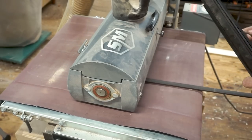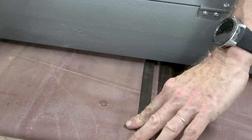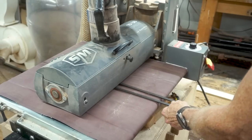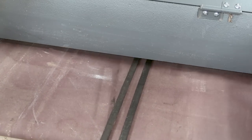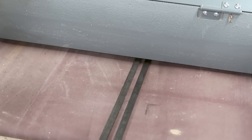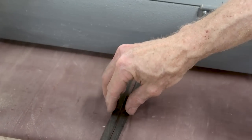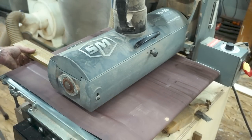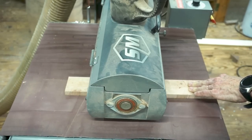Next, I'll take some pieces of ebony and prepare them to be the dividers. I never throw out anything, so these are leftover pieces of ebony from another project that I had tucked away. I just need to sand them all to the same thickness. They ended up to be around 3/32 of an inch thick. And then I'll sand all the pieces of Cocobolo and maple burl to remove the saw marks and get them to a consistent thickness on each side of the board.